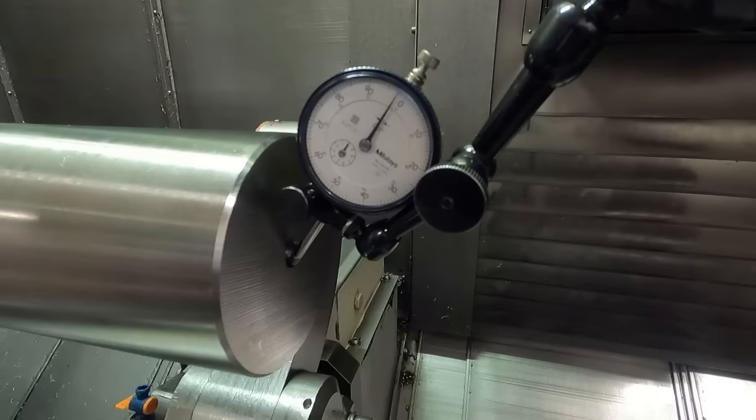Now I've got the strap on the part. I'm gonna move it back as far as I can. And we're gonna lift the weight of the part on the crane here. Now it still won't really be balanced, but it'll be better. See, I got the weight on the crane now, and I can push down on this so I'm not dragging the end of the part against the spindle bore too much. Well, I'm just gonna pull it out of here. I can kind of shove it down. You see all those shavings on it? I don't want to drag that across the chuck jaws or anything.